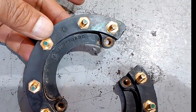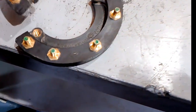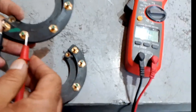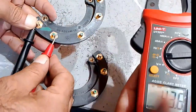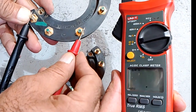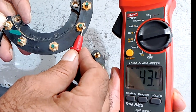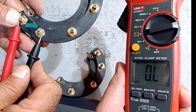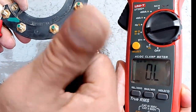This is the positive diode and this one is the negative diode. It should work in just one way. Keep the black wire on the first pin and red on the second pin — the reading is 43.5, and all three of them show 43.5. Now we flip the wires and there should be no reading. There is no reading, which means the diode is OK.